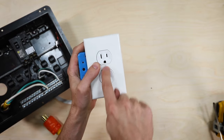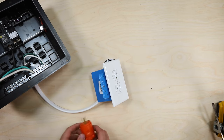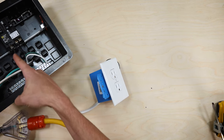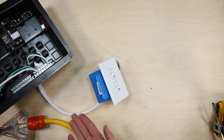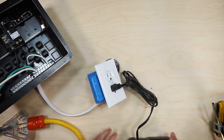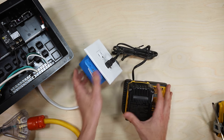Good workmanship right here — make sure your screws are either straight up and down or straight sideways, whichever you prefer. Now that this outlet is good to go, I'm going to connect this into just an extension cord going to the wall. It's important to know that that screw right there is hot and would shock you, so be careful now that it's under power. Turn the breaker on to this circuit, and then now we should have power here. We plug in this charger and we are indeed charging — a little battery charger for our DeWalt equipment. This is how you wire a single outlet.